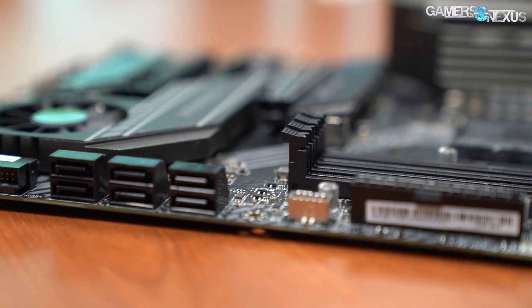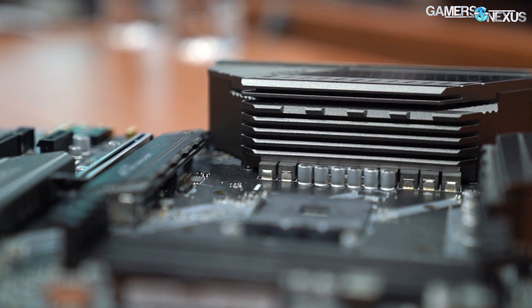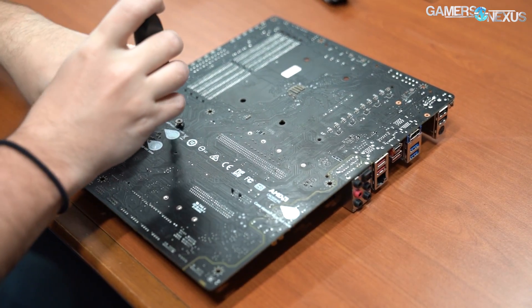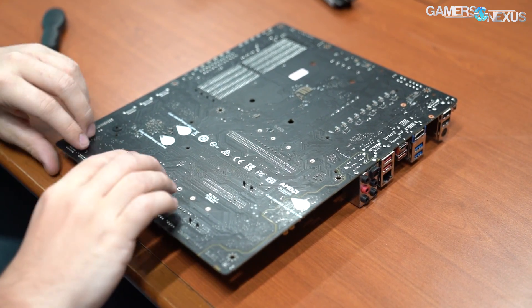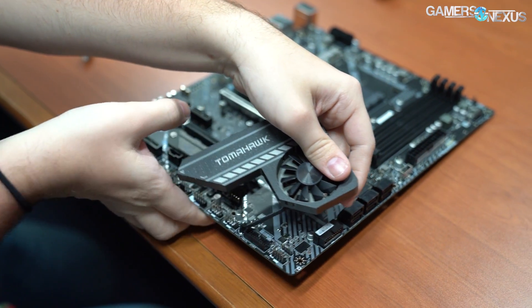So first, for the motherboard — it's the X570 Tomahawk. This board was shown at CES and not too much has changed, but now it's being positioned more strategically as a response to concerns about MSI's VRMs running among the hottest of the X570 boards. MSI says the memory topology is mostly unchanged — it's still daisy-chained — but they have a couple of updates between PCB versions 1.1 and 1.3. Version 1.3, the full retail version, will have improved spacing between circuits, which should improve memory performance and overclocking especially, getting it closer to the rest of MSI's X570 lineup.